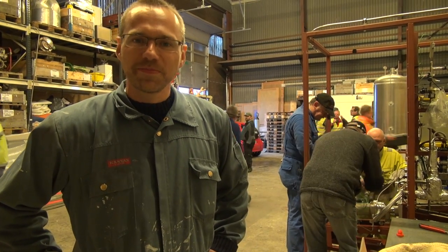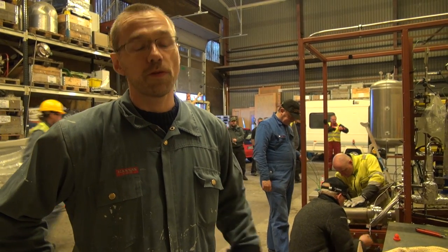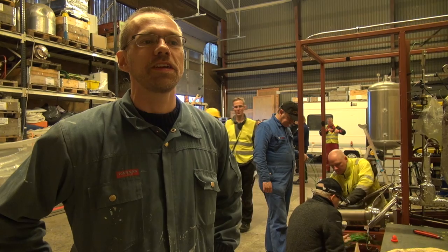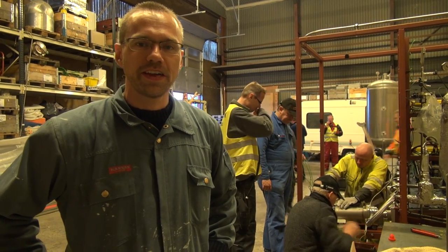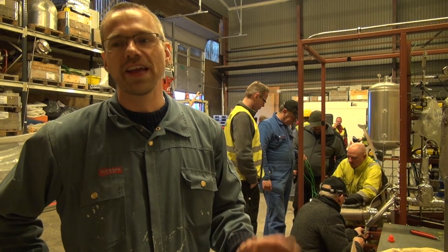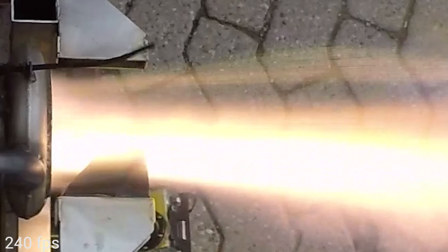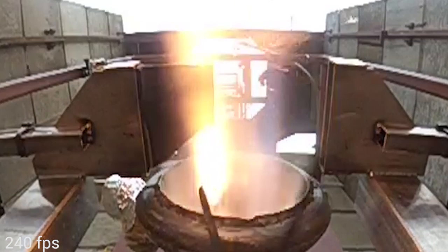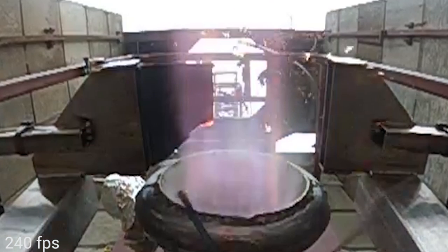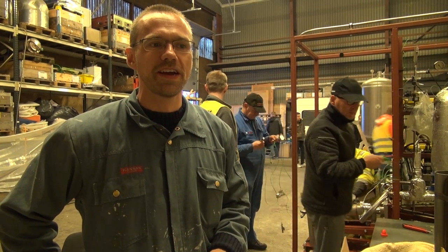It's been a day of mixed experiences. We've had a few hardware and software issues, but we've also had two completely nominal burns. And the graphite jet vane survived them all, though it had some wear and tear, and at one point it was damaged by the igniter, which obviously gets shot out of the engine as it starts, and it's a known issue that it can hit the injector, it can hit a jet vane and damage it, so we'll be working on a better design to mitigate that.